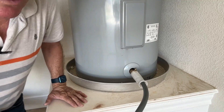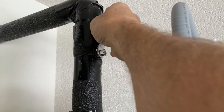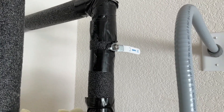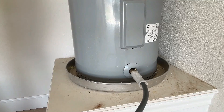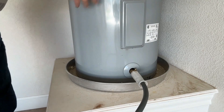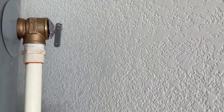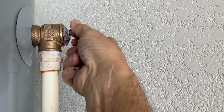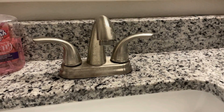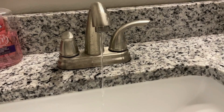So I'm going to shut the water off. To do that you simply turn this valve so it's perpendicular to the pipe — now the water is off. But there's one more thing you need to do: if you simply open the valve it's going to try to pull a vacuum in the water heater. So you can either open up the relief valve to allow air to be drawn in, or open a hot water faucet, which will also allow air in and help it drain better.